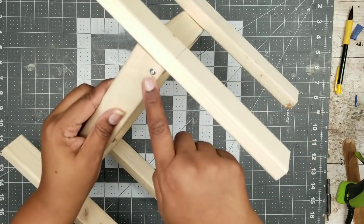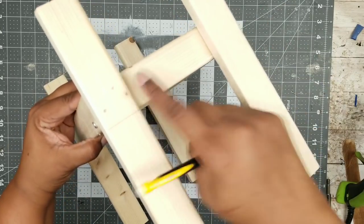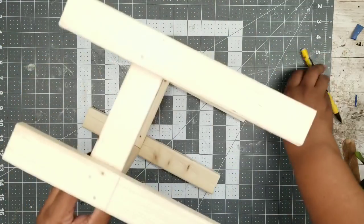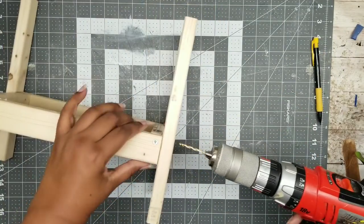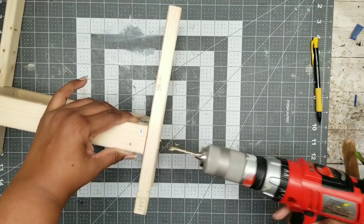So in order to screw these, we are going to apply 2 screws in a diagonal pattern. Now we want to make sure that we do not screw over that existing screw, so make sure your bottom screw on that diagonal is above the screw you just screwed in the corner. Now again, taking my drill, I am going to drill 2 pilot holes, again making sure I'm right above that screw, and drilling another one in the diagonal as shown here.